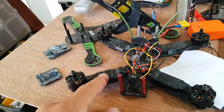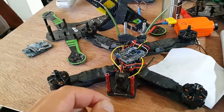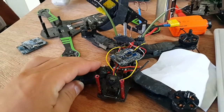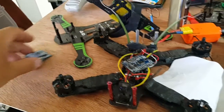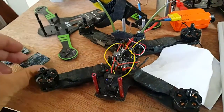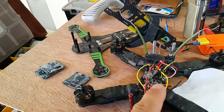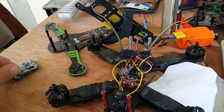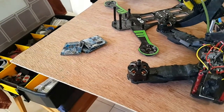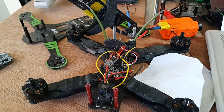One of the ESCs I knew was having a problem. I had this flight controller here, so I took it out and said okay, I'm gonna test them one by one to see which one is the bad one. Unfortunately the first one I tried on this flight controller from my main quad — it was the bad one. So I tried again with a third flight controller, and I threw away all those ESCs.